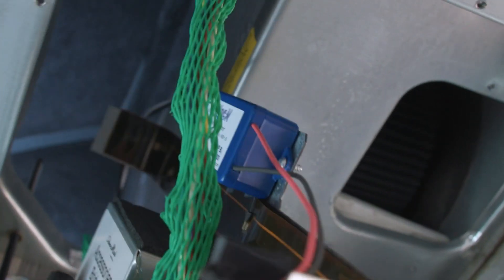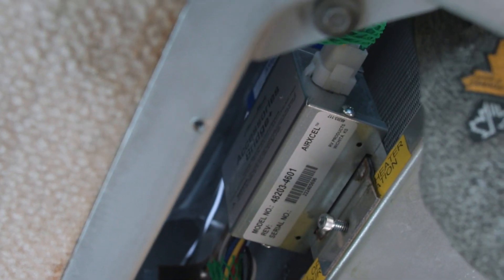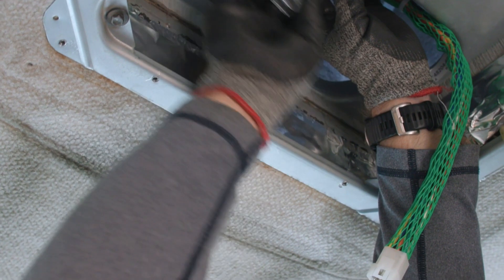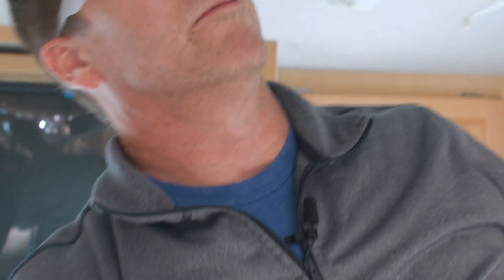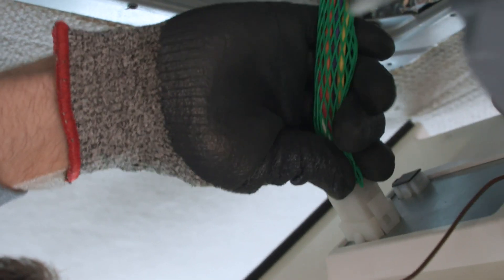You cannot have both. So now we're going to push this up towards the side, bring it back over, and slip this bracket over the sheet metal flange. We're ready to center this up in the opening and use our 3/16 Allen wrench to tighten the set screw. We want to tighten this to remove any potential movement of the air purifier from coming loose. I have a ratcheting tool to help install this faster, but it's still using a 3/16 drive. Once we've got that in place, we take the nine-pin from the air purifier and install it into the top of this non-ducted ceiling assembly nine-pin, pushing it on to get the ears to clip.